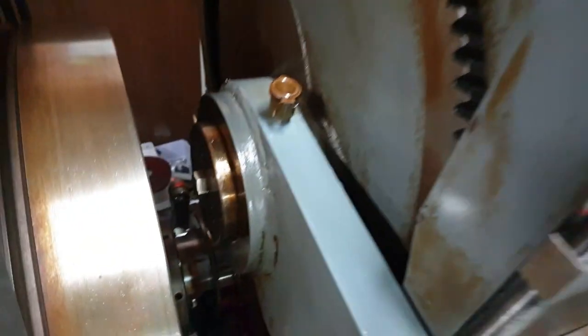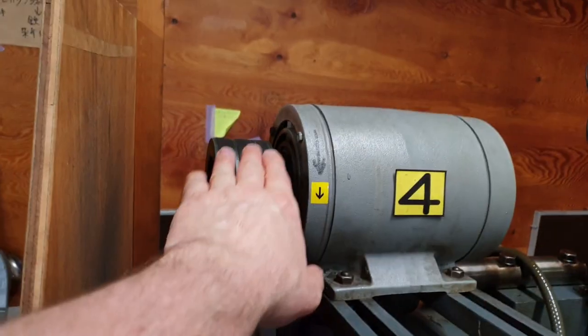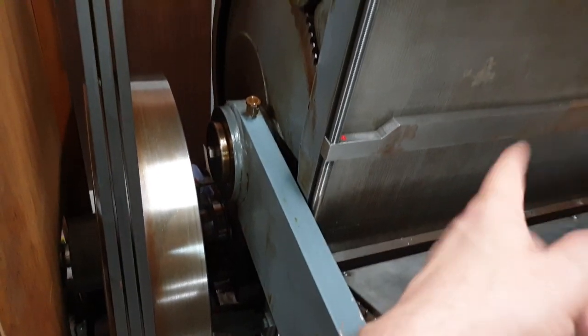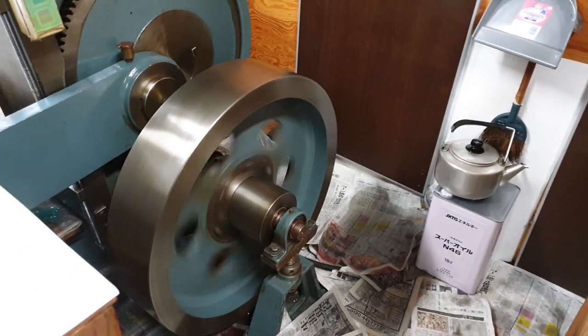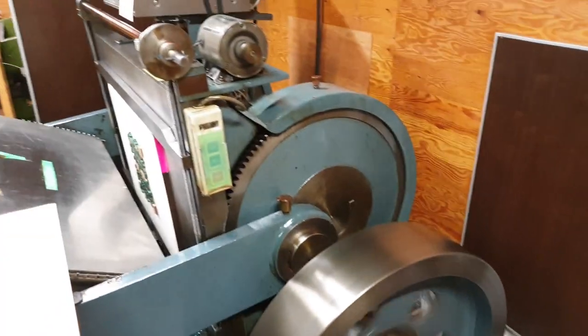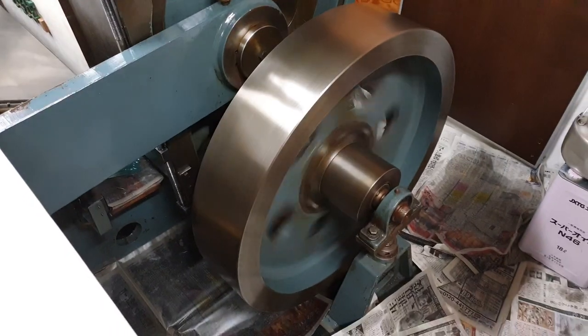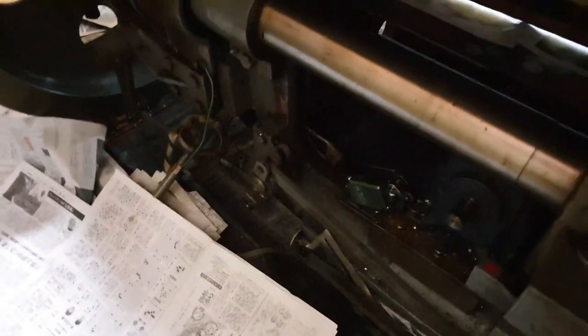What's happening is this, after a while, it's stopping halfway because down in here we've got a clutch. Just at the end of my finger there is a clutch. This is a flywheel connected to this motor. This spins and it's got another flywheel, just an idling flywheel, just on the other side down there. This machine here is idling away, just like that. Nice and open frame design. About 50 years old these machines are. The general thing for these machines is not to be used by idiots — don't go sticking your fingers where they don't belong. There's the clutch there. That gets pulled in by these pull rods down the bottom there.